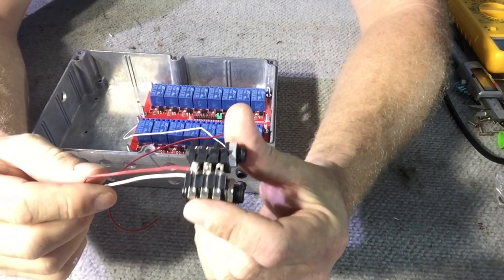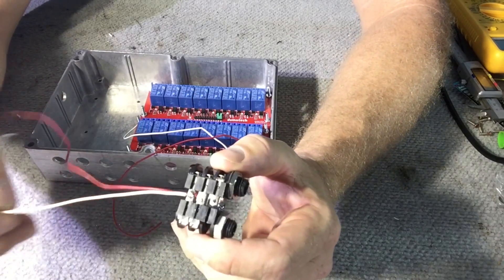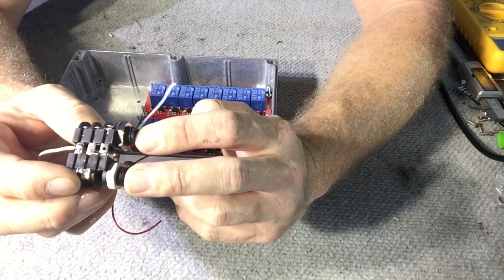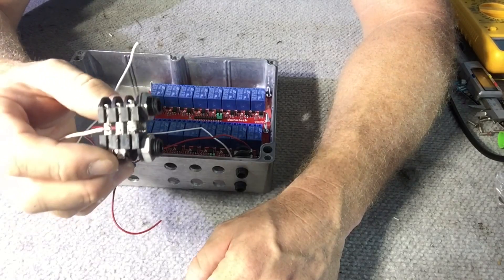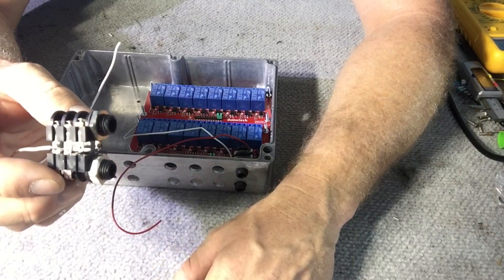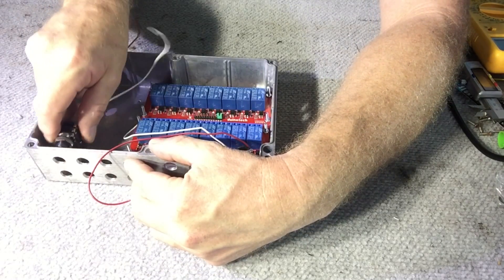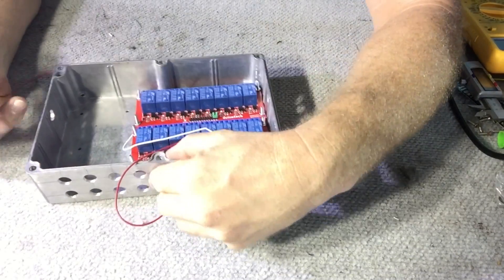Here's what I've done with the input and output jacks. I've actually soldered them together — one wire will be input, one will be output. In this configuration, when there's nothing plugged into these, it actually acts as a through. So if you have nothing plugged in and it happens to be programmed in, it will still work — it'll send the signal straight through as if there was a cable plugged in. These line up so they'll go through like so — that shouldn't be too bad.